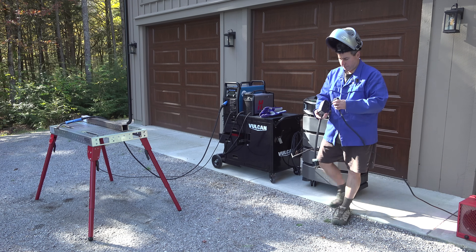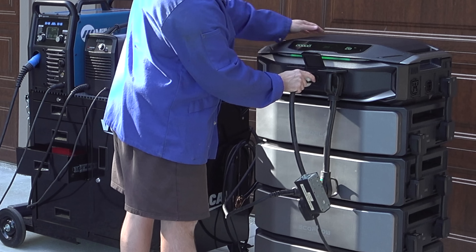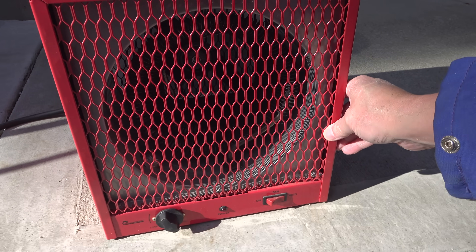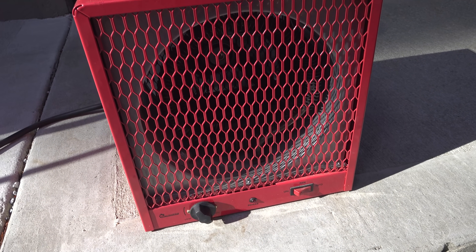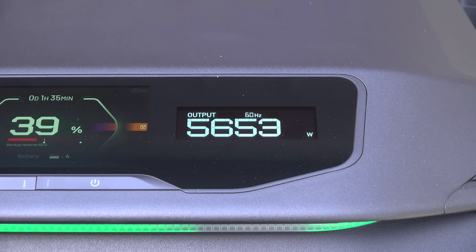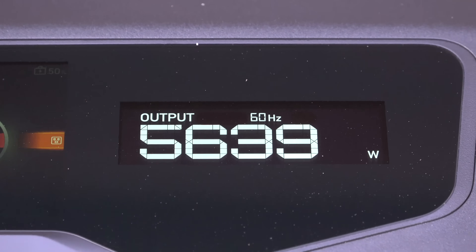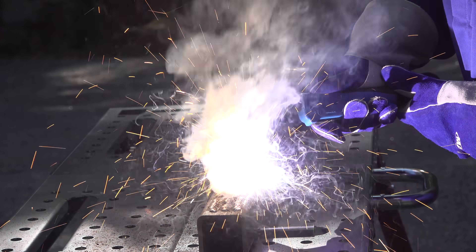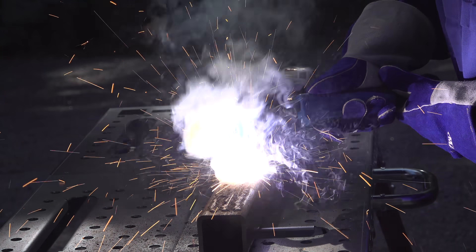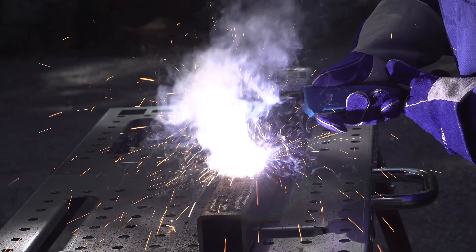I still wasn't getting even close to that 12,000 watts, so to mix it up further I'm going to pull up my old reliable — a 240-volt heater that draws 6,000 watts when it's running. I'm going to plug the heater into the 30-amp outlet and the welder into the 50-amp outlet, set the thermostat to max, and turn the heater on immediately. The heater is drawing about 5,600 watts. Now I'll go ahead and do some more welding and see how far we can push this thing. This closely simulates what you've got in your house — electric dryer, air conditioner, all sorts of different loads constantly turning on and off. That kind of surging is really what could cause an inverter problems or potentially damage electronics.